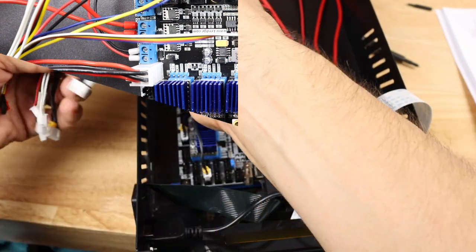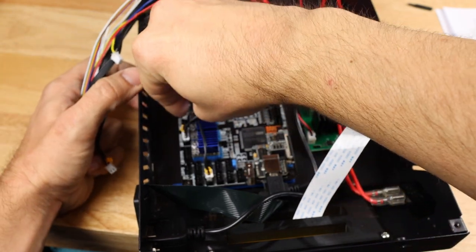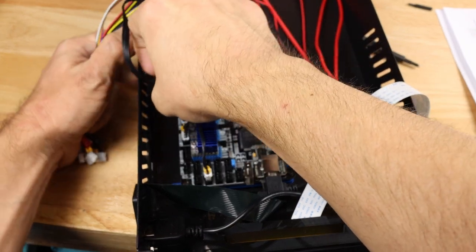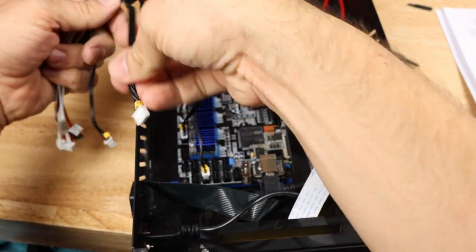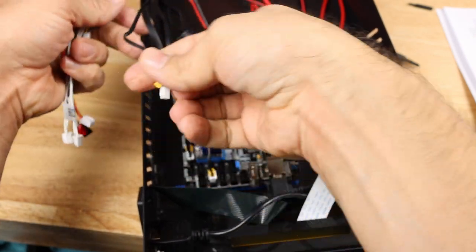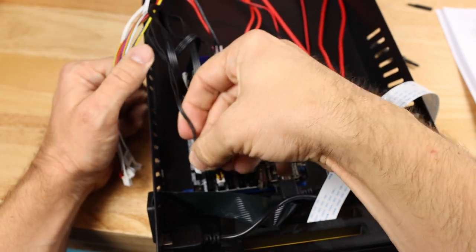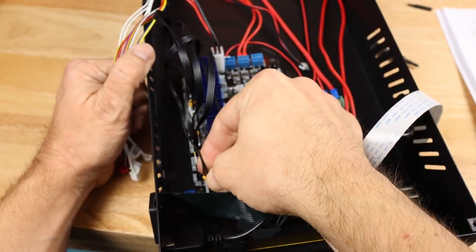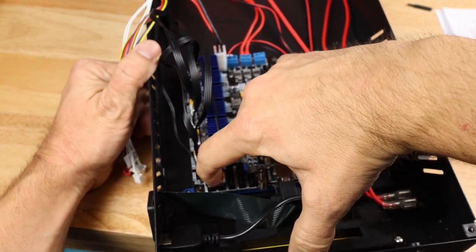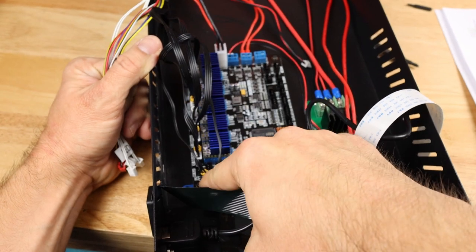That's all I wanted to show you, and we will move forward and you'll see the configuration of this later. I'm going to put Z1 onto our Z motor. We've got E, which is going to go to E0. Got X, which is of course going to go to X, and that has the X end stop attached to it. That's going to go, again, towards the top of your screen, right here, again going to ground and signal, leaving the 5-volt pin open.